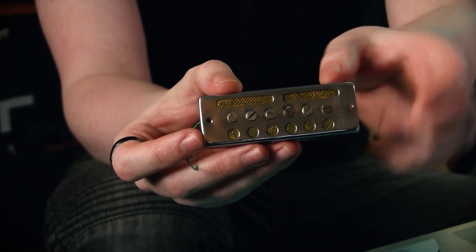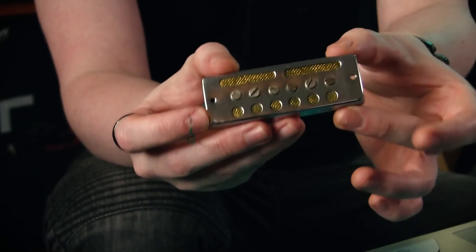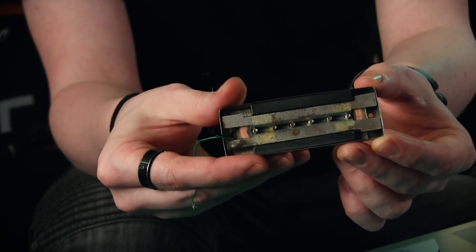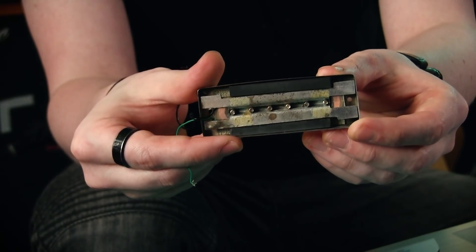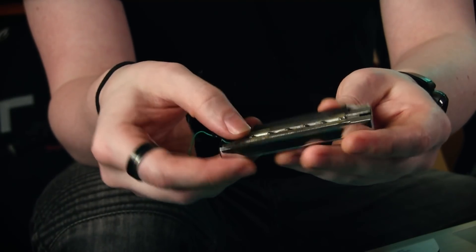This is a cheap gold foil. Gold foil is a general catch-all term for any number of pickups that feature these design aesthetics where you've got a gold foil under some sort of fenestrated cover - it's a decorative term rather than one that describes any specific style of construction. Turning this over, we can see it's missing a back plate and is of fairly normal construction for gold foils. The coil is wound to a plastic bobbin in the centre, the pole pieces are screwed through a bent steel core which holds the cover, coil, and steel core all together.